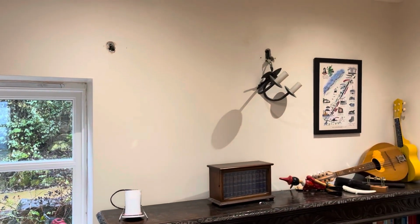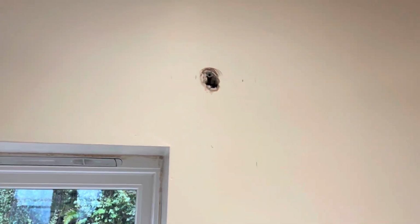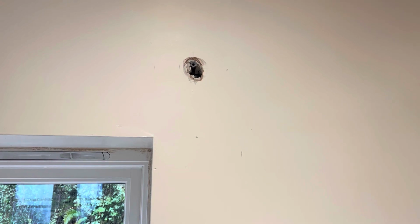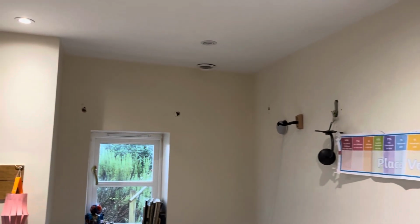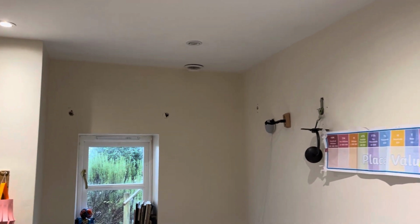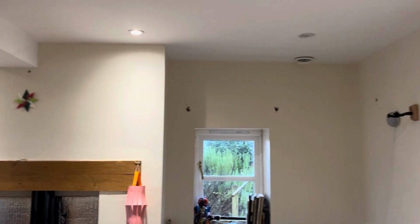And now I'm going to stop these up with rock wool, just to stop any air from leaking out through here. Keep it insulated as much as possible. Put everything back, and I'll wait over the summer for everything to settle, and then I'll top them up again before the winter starts next year. And we should have a much warmer room, or a much cheaper room to heat.